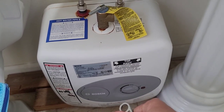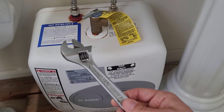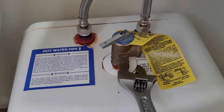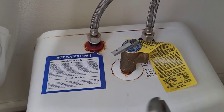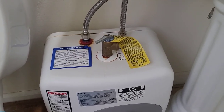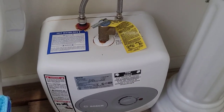This has been in service since 2017. Here we are in 2023 and the reason I'm going to be changing it out is for preventative maintenance, because as you can see we're starting to get some rust points here on the overflow pressure relief valve and also on the hot water output. It's starting to leak on top and you can see the corrosion stains here. I don't want to take a chance on this actually starting to leak, so we are going to swap it out.